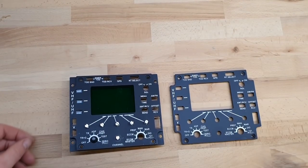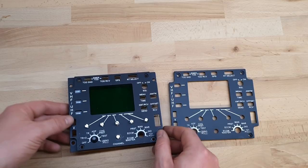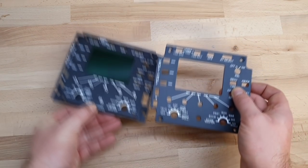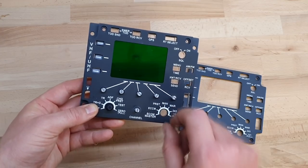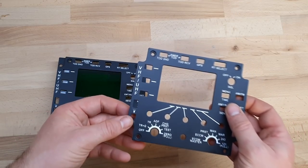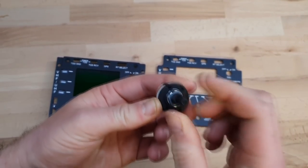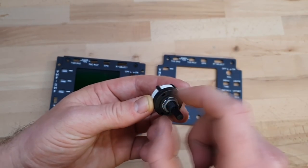I quickly wanted to raise another issue. This was the original panel I was working on - I realized I've designed it to run a 10-position rotary, but this one here is a 12-position rotary. You can see how the angles are a little bit different. The realistic one is actually a 10-position rotary with a 36-degree throw on each knob, but I'm going to run with the 12-position which has only a 30-degree throw. I use these rotary switches throughout basically the whole cockpit - they're really cheap and you can set how many points you want by moving the washer.